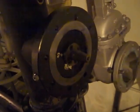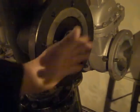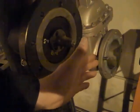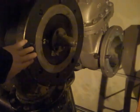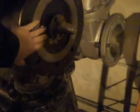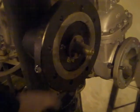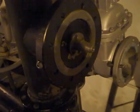This is the drilling rig that has the completion plug mounted in the end of it, and they'll use that to set the completion plug in place to seal off the system from the atmosphere. This is the completion plug installed in the flange. The gate valve was here, they attached the drilling rig to the gate valve, and set the completion plug. Underneath the cap screws are set screws that hold it in place — there's a groove, like a recess, all the way around the completion plug that holds it in place after you run the set screws in.